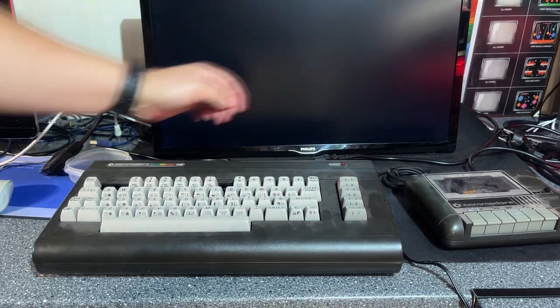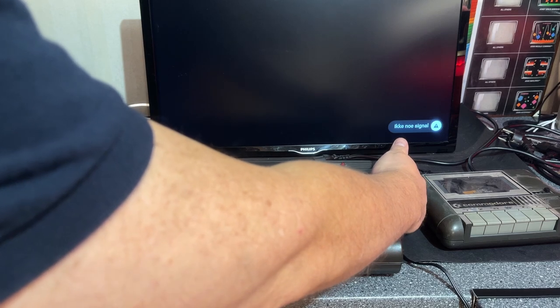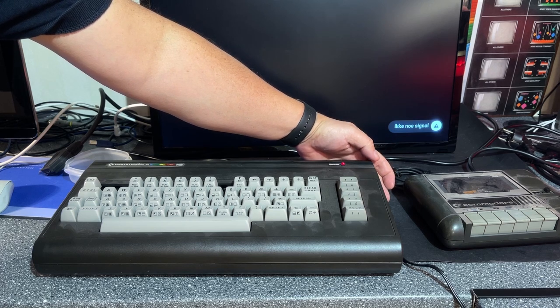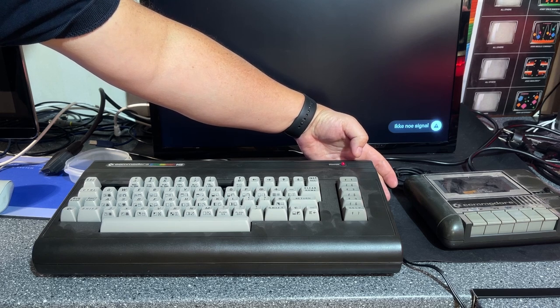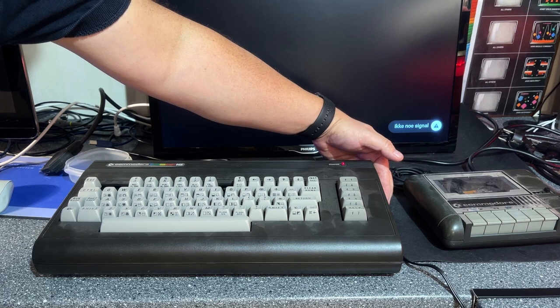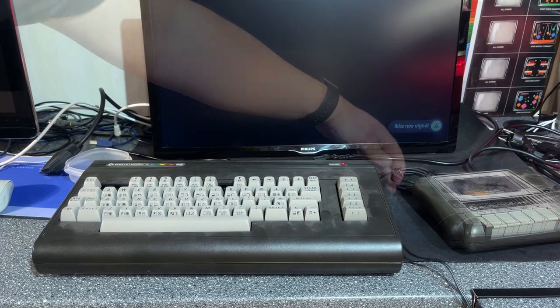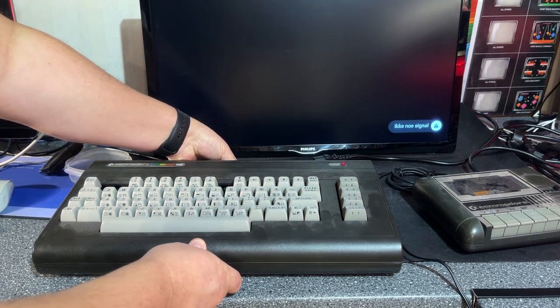Turning on — and there was a brief flash in the power LED. I think there is some bad contact, because if I touch the contact the power LED comes on, but if I wiggle it a bit it turns off. So there's obviously some bad contact on this power connector that I'll need to address. If I turn on the TV there's no signal, but there's a lot of audio noise. So something is going on here.